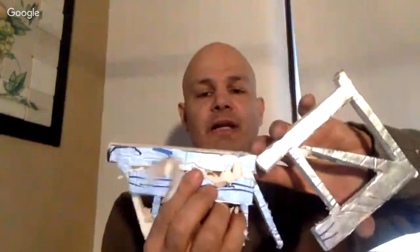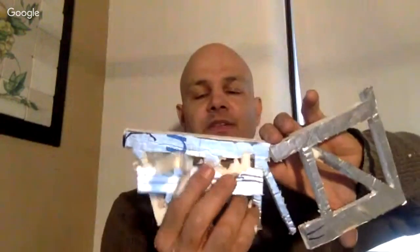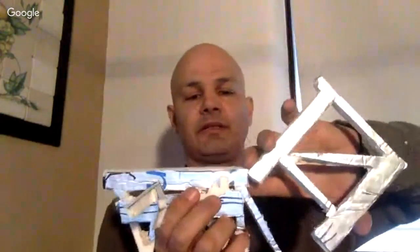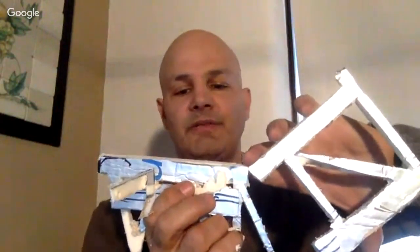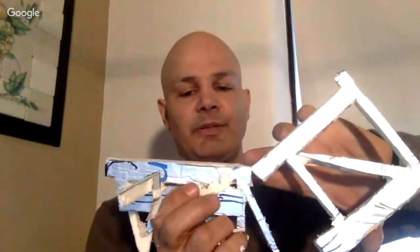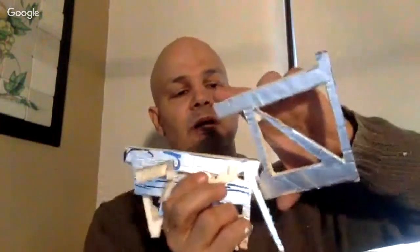And you see it on top of the bottom deck. These uprights, these diagonals crushed. It couldn't take the load of the impact. The impact load was enough to break them, cause them to buckle to complete failure and then crush. And this guy did not buckle and crush because it never made it to the ground with the impact forces. So that's what that looks like. And there's my model.